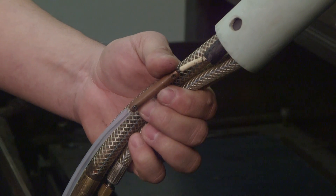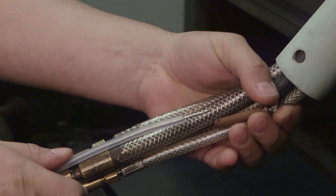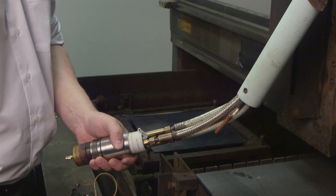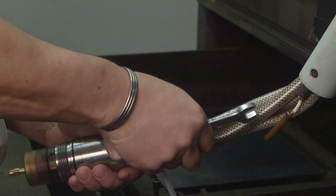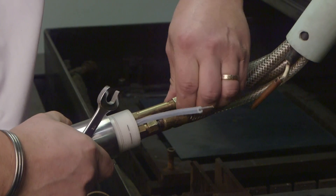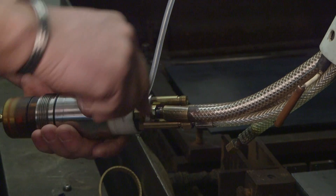Or fold up the knife connector and disconnect for the PT-36. Once this has been disconnected, bend the pilot arc wire out of the way for easier access to the fittings. Using the 1/2 inch wrench, disconnect the shield gas line. The shield gas line has the longest pipe, with a 1/2 inch nut.